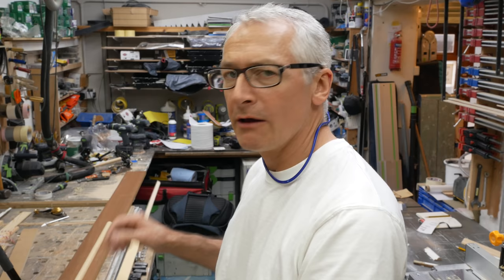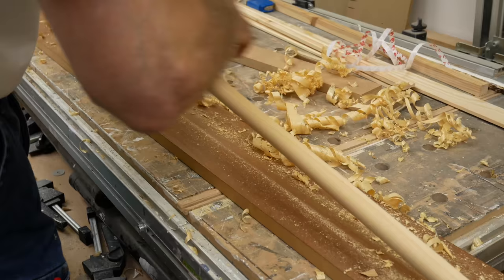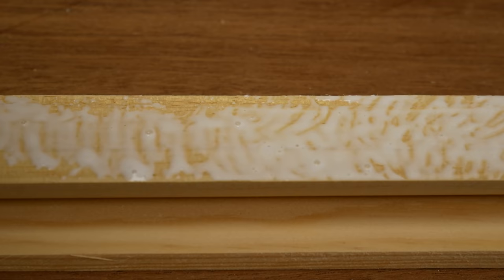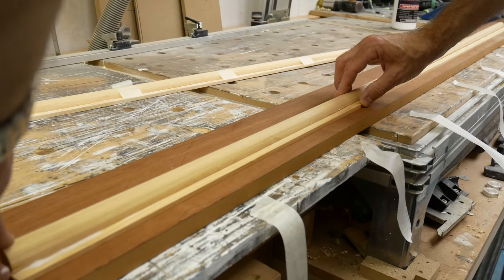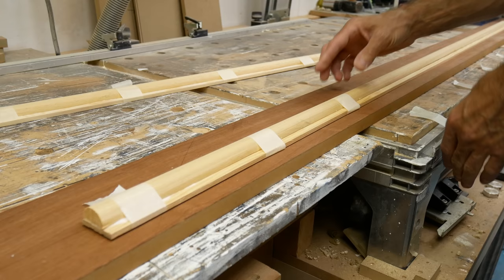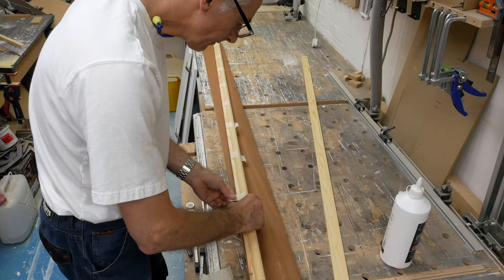All things considered, that worked surprisingly well. A little bit thicker at one end than the other, but I don't think that matters too much — I'll give that a quick whisk of a hand plane to get those down a little bit more even. They're going to be extensively filled and glued and pinned onto the backing piece. So we've ripped the strip of the backing piece down, and I've planed that with a very slight bevel on the edge. Now we're just going to glue the half round piece onto it, just to give us that sort of profile. I'll get that glued on tonight and it can set overnight — we'll just tape it up. It's tempting to try and put pins through the back, but a little bit of sticky tape should sort it out. I want to get some glue on this and get it set tonight, so I'll catch you again in the morning.